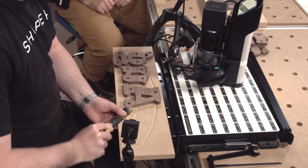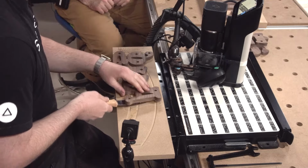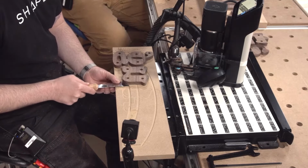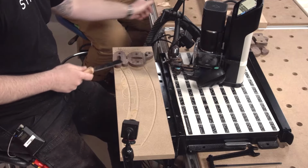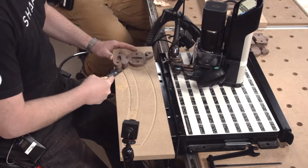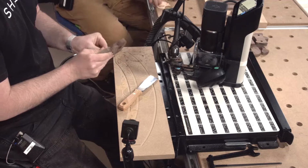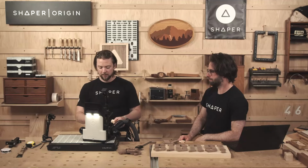Notice how for the letters that I really care about, I use that flexible, thin, sharp scraper to wiggle my way under and not damage the underside, which is really the front, which is the face. This stuff's pretty thick, so I'm not really too worried about cracking it. But when we're doing inlays that are 1/8 inch material, especially exotic species that have really brittle grain, you've got to be real gentle with it. Why is it the exotic species that always have the brittle grain, Jake? I don't know, but like Wenge and stuff loves to just crack right down the middle.